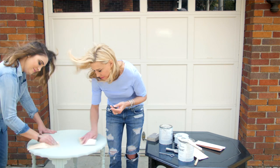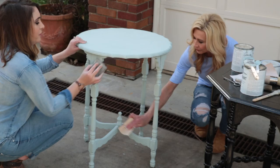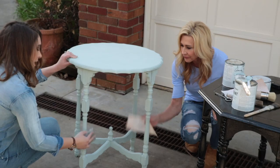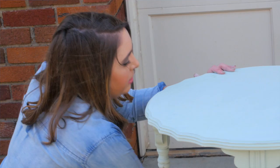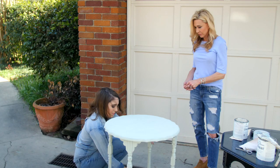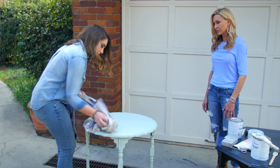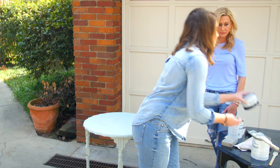You can sand as little or as much as you like. Sealing is really important for the durability of the finish — all chalk paint has to be sealed, either with furniture wax or poly acrylic or polyurethane. On the legs you get a lot of detail showing through the sanding, and the sanding block is especially helpful there to get into all the little nooks and crevices. You can get the sandpaper and sanding block at Lowe's or any home improvement store.